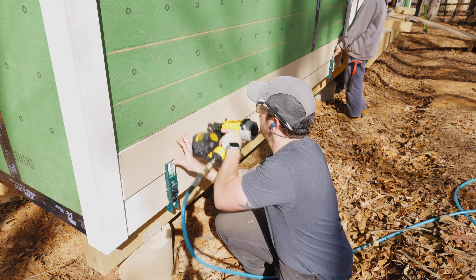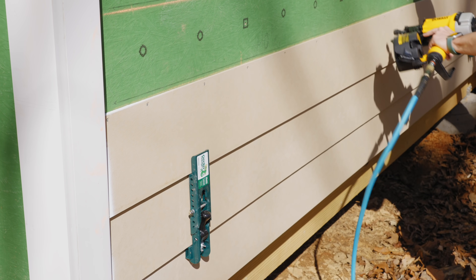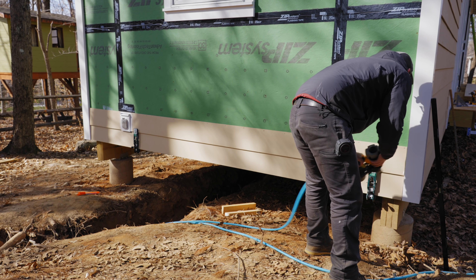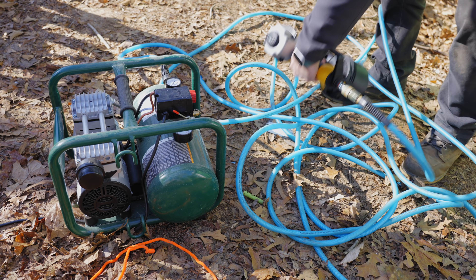The big nailer here was the siding nailer — that's what I used to attach all of these boards. I used two-and-a-quarter-inch ring shank siding nails, added every eight inches, which ended up being a heck of a lot of nails. Those siding nails came on big coils so I wasn't constantly reloading the gun. As far as I'm aware there are no battery powered siding nailers, so we did need to run a compressor and air hose. I used a polyurethane hose — they're way more flexible than the cheap hoses you might have gotten with your compressor.